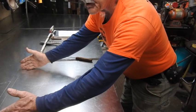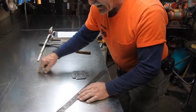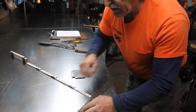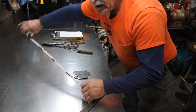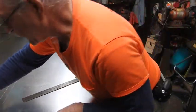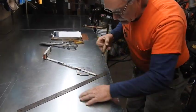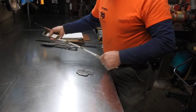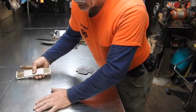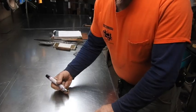Now what we have to do is come up with a radius that does not restrict the 20-inch dimension. If we just run a line down across here, we're dropping dramatically the 20-inch dimension from the inside of that throat to here — we've already dropped down to 16 inches. So we know we're going to have to be down here a pretty good ways in order to maintain 20 inches all the way across. That looks like a good approximation right about there — it's about 10 and a half inches, so call that 11 inches because that's easy to remember. Put it 11 inches down from here; you should be able to connect these dots and add one quarter inch for the quarter-inch 90. There's our basic layout for both sides. You can double-check to make sure you maintain your 20 inches across there — I dropped down to about 19 and 3/4, which is not really going to matter much. I've overdone the return air capacity of the ductwork for the wood furnace anyway, so that's going to be just fine. There's our layout right here.